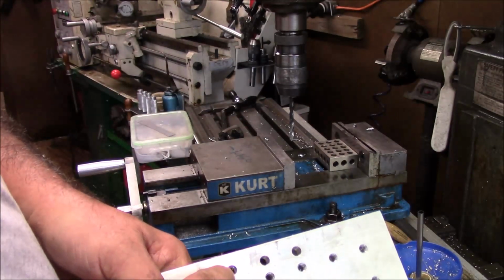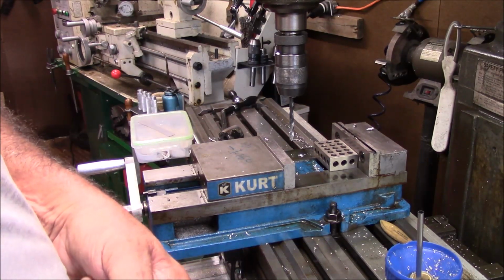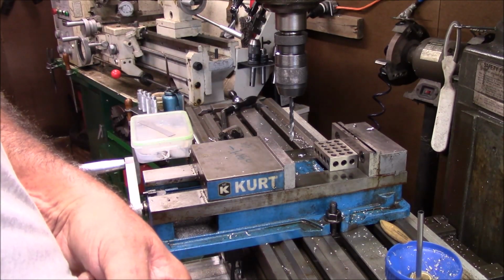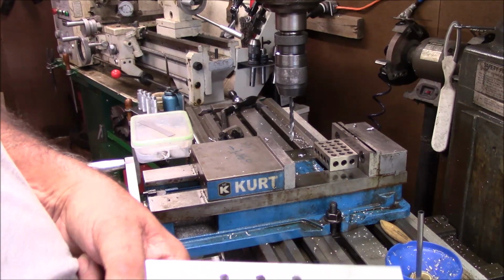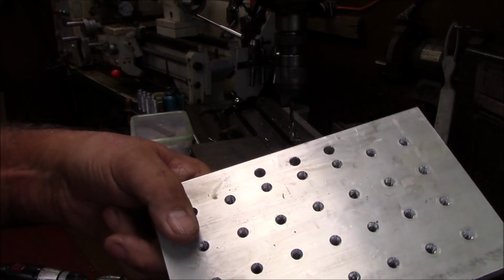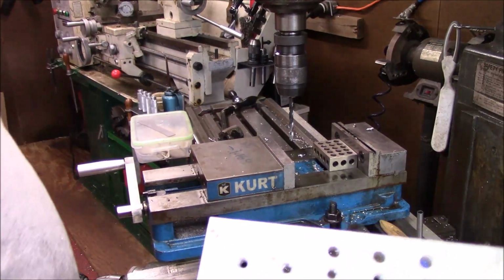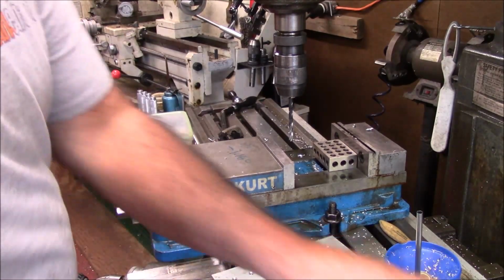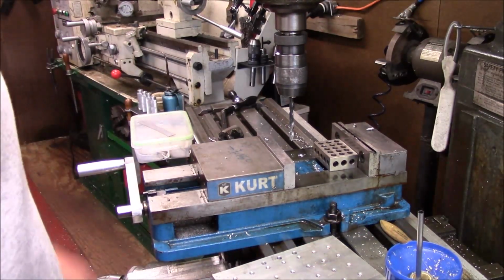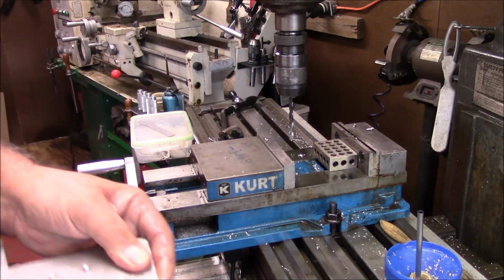Basically, I come down here to half of this distance here, come down here 1.5 inches, and drilled 3 holes 1 inch apart with the clearance drill for the 1/4 20. So that there will give me, basically allow me to have what I need. Now, I got to go back to this piece, which should bolt right on there and line up like this.